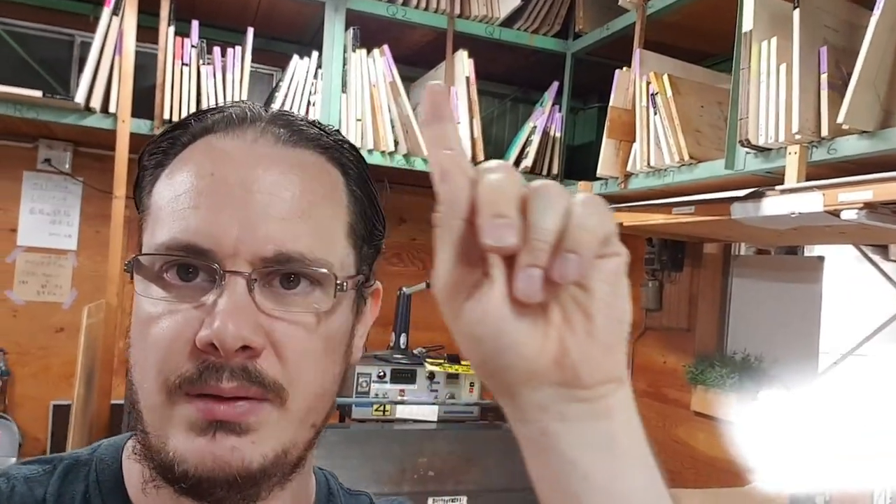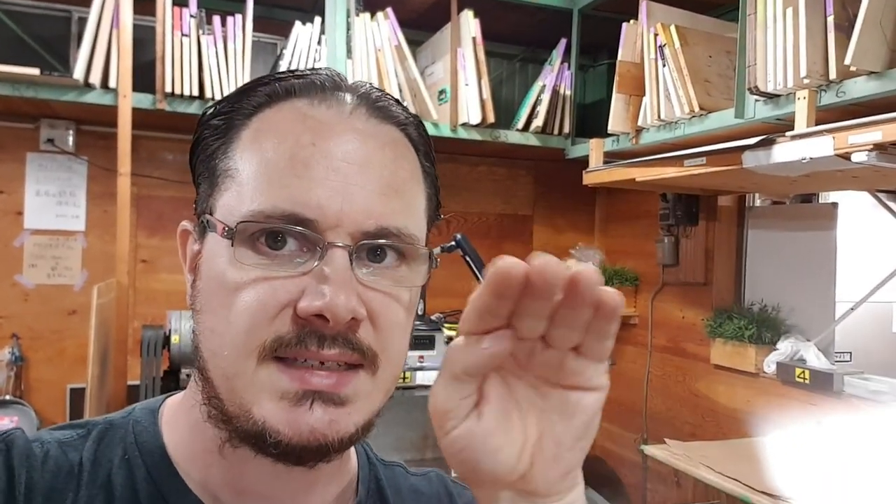The bits of wood above me, all the way around here, they're all different shapes of a die cutter. It's like a bit of plywood with a blade that's inset sticking out at 90 degrees to the surface of the wood, and that goes in the die cutter. So when the operator hits a pedal or it's on a timer, it closes up, cuts the plastic, opens up, you pull the bit of cut plastic out. It's for making things like signs and placards, and like when you open up a cardboard box and you've got the shape of that cardboard — you can do that with plastic as well to make plastic boxes.